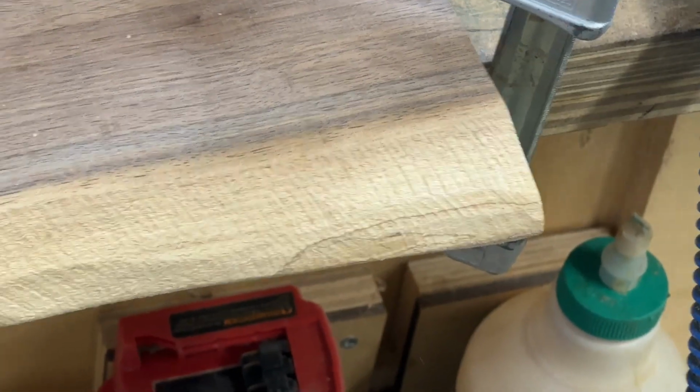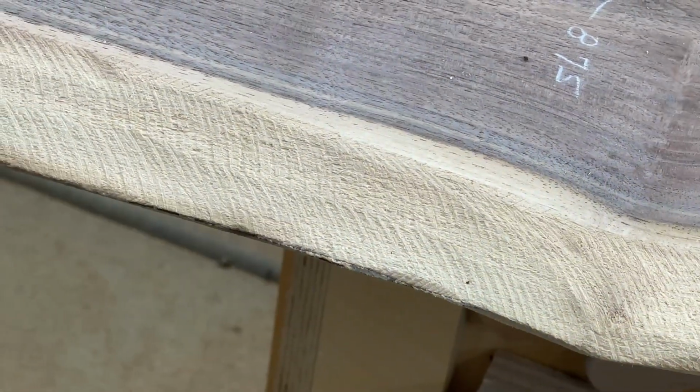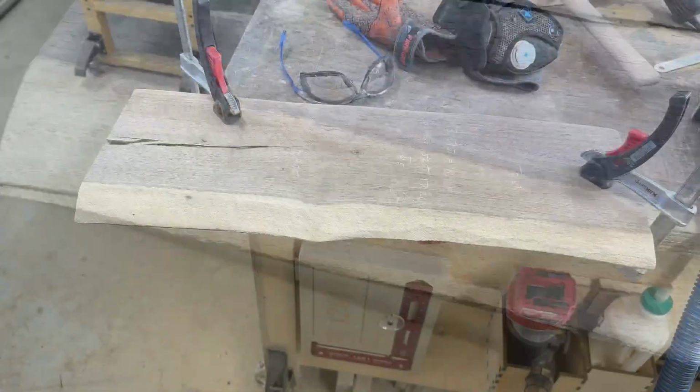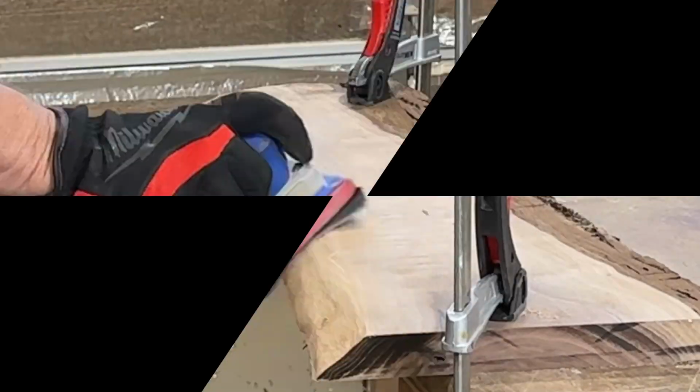As I'm carving this board with that grinding carving wheel, you can see I get some deep grooves in some of these places. And I could just leave that in there, that's fine. I prefer to not have that in there, so the next step you'll see me doing here is taking out those by using 80 grit sandpaper in my Surf Prep sander. It's got that nice foam interface. I could use a higher grit sandpaper if I had it, but that's the lowest grit I have, 80 grit.